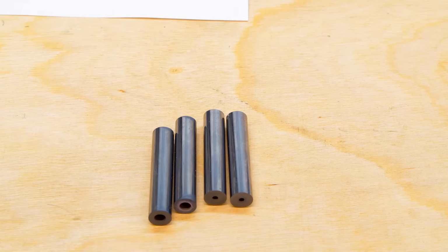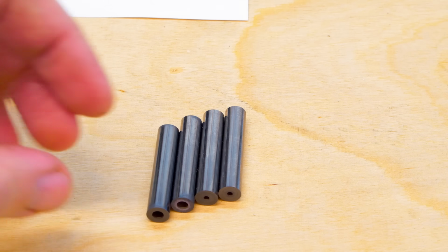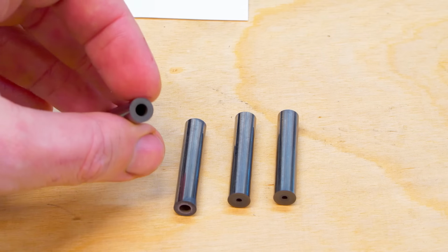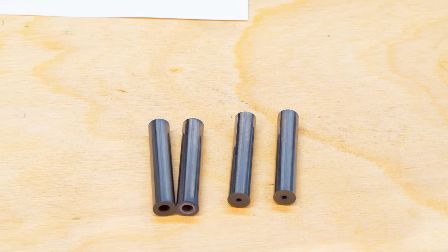The wire EDM that he runs is a little bit on the older side, and he is hesitant to try to hit tight tolerances with it. Plus, the surface finish of wiring the bore is not as nice on an older machine as I would like it to be. So that's the reason why I have them cut undersized and then grind them to final dimension.